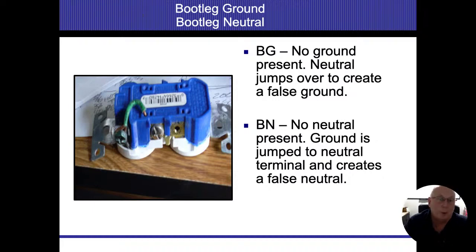This isn't the best practice, and the drawback with this is many of those three-prong testers we use, we don't really find it. This is one of the cases I make for why I like non-metallic cable. When we're dealing with non-metallic cable, for the most part, they're going to have an energized, a neutral, and they're also going to have a grounding wire in there as well. So if we end up replacing some of these things, then we can still make sure that everything is grounded.